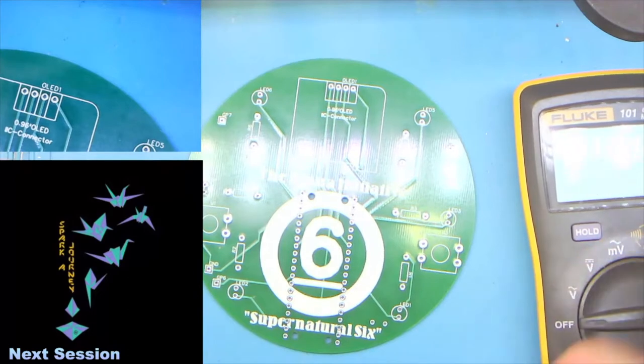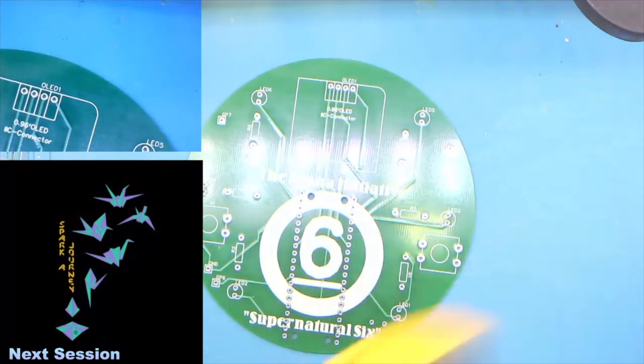Like I said, you don't have to go. This one was a little spendy. The $10, $15, $20 one you see at Walmart is fine for a beginner. Just make sure that it does have those three functions: resistance, a diode function, and continuity.